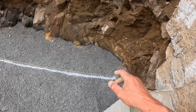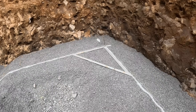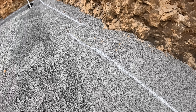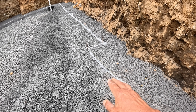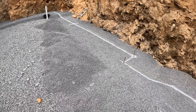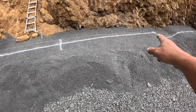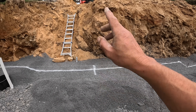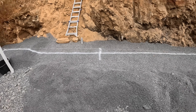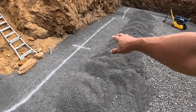All right, so we are all set, ready for the walls tomorrow. We got our corner staked out — that's the outside of this wall coming down here. This is the outside corner. The walls are ten and a quarter of an inch thick, so that's the outside line, and the wall is going to run this way. It's like the footing of the wall. There's a little jutting — that line is not crooked, it just dips down because we're going to be putting those big pads in here, those concrete footings. There's going to be one right here on this junction, and then the other one is going to go at the center of this wall. They want it at the center because of the span — this wall is like 26 feet — and there's going to be a lot of load on this; there's a big main beam support to hold up the first and second floor. All in all, we're good to go for tomorrow. We have some extra stone here, so once they sit these pads in place we're going to shovel this in and give them a spot to rest the walls on.